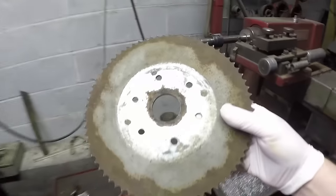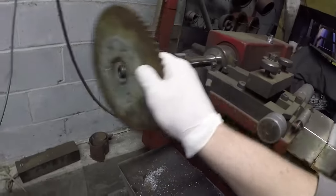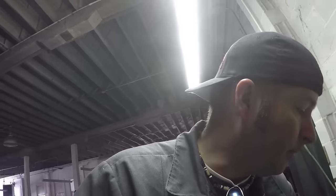Yes, sir. So we're going to turn the end of that thing down so this sprocket fits nicely on the end of it. We've been just welding sprockets onto the end of these collars that we've been picking up at Agri Supply or Tractor Supply. They're used for making your own sprockets. They provide sprockets with the right size hole in the center to fit on that. But we're not getting their sprockets. We're getting our own.